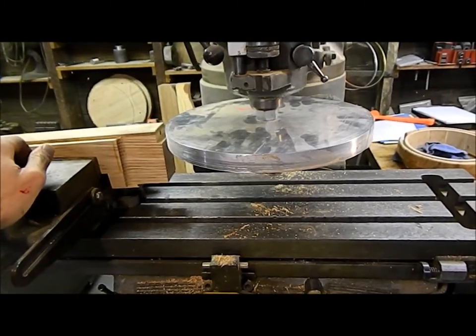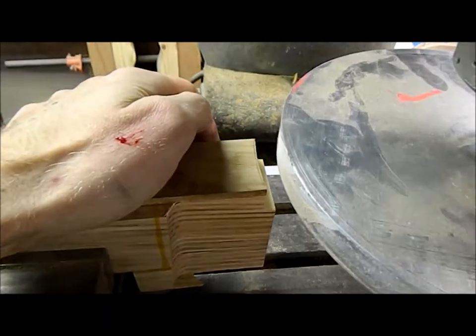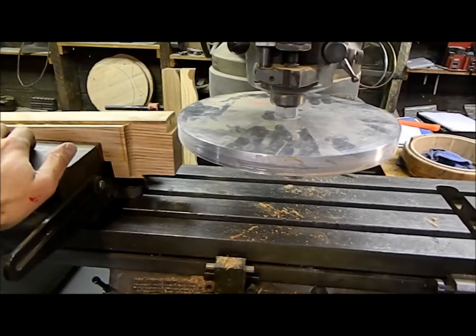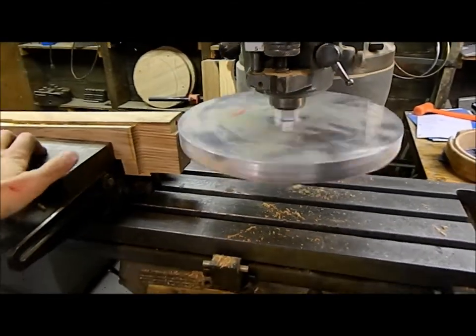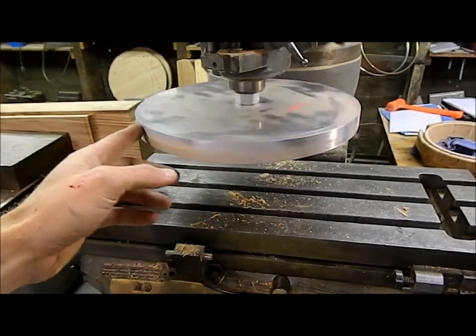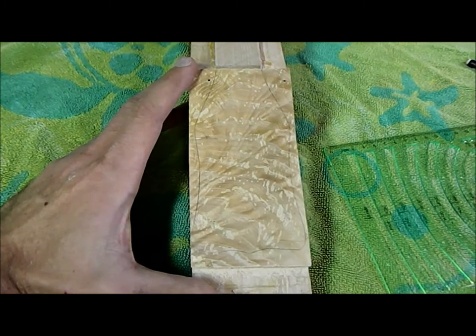All right, so this is the homemade Widowmaker cutter. And so we removed most of this material in there with the end mill. And all we do is fire this up on back gear granny low and sand her in. So even on her lowest speed, the surface feet per second on that is screaming. So I just have a little bit of sandpaper stuck to here and it just sands it right in, and that's it. Simple.